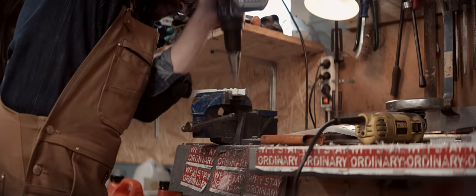Well, that concludes this video then. I was actually hoping for some more testing, but I found some bits and pieces from the variator, mostly broken weights and a couple of washers. I'm missing the nut. The nut is a special 14 millimeter weird thread thing. I haven't got taps nor any more nuts of that size, which is a bummer because I'm suspecting my fuel filter is a problem now. And maybe the tank went.